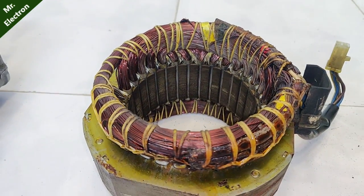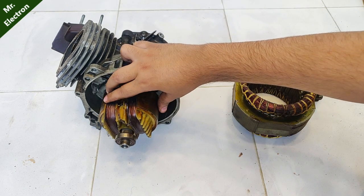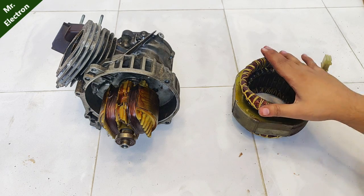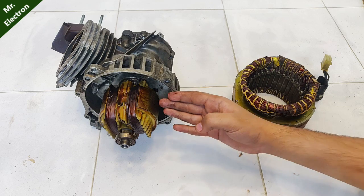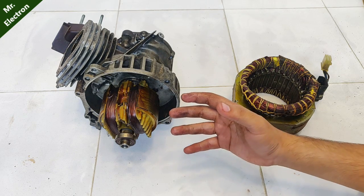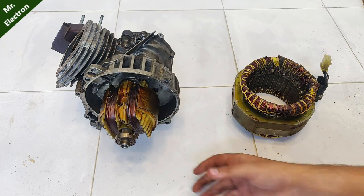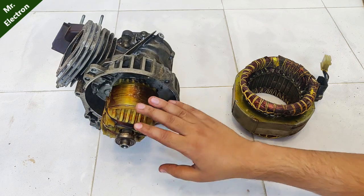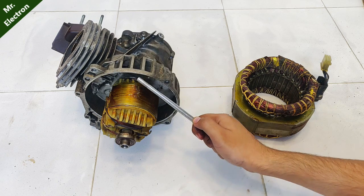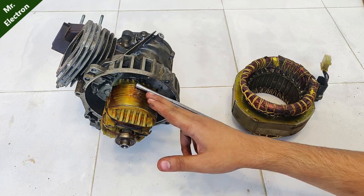This is the main armature winding from which the voltage and current are going to come out and feed your load. The basics are that this rotor needs excitation to induce current in the armature winding. Because brushes are not available and no external cable has been provided, there must be some kind of magnet to excite the rotor windings. The method the company used was this small square piece — that is the magnet.